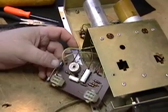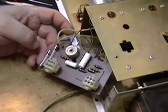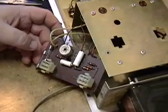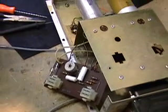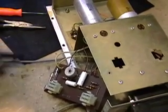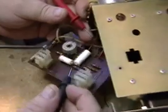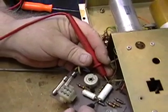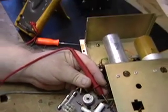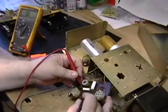And these are the two speaker fuses here. But we don't seem to have any other issues here with the regulator at the present time, and we're just going to check the electrolytic capacitors to make sure that they're not shorted, because that's a frequent cause of problems. That one isn't. That does not mean that they're not open either, by the way.